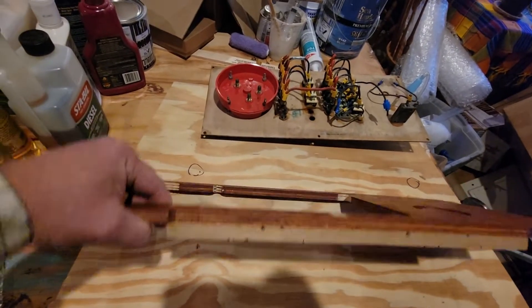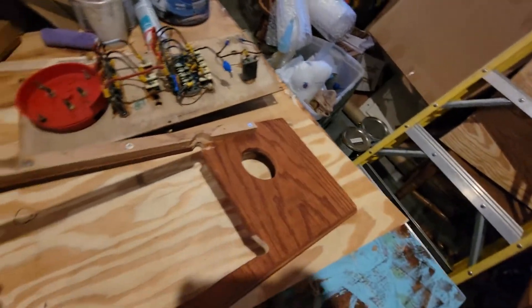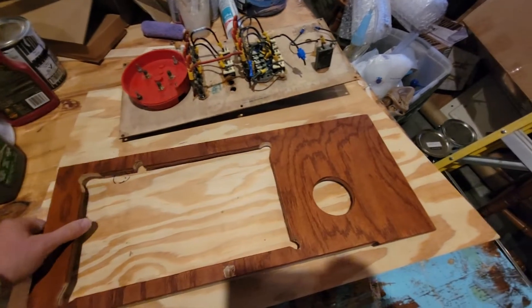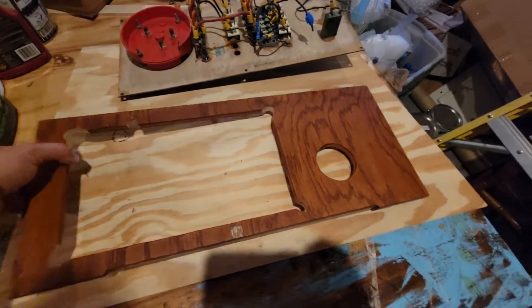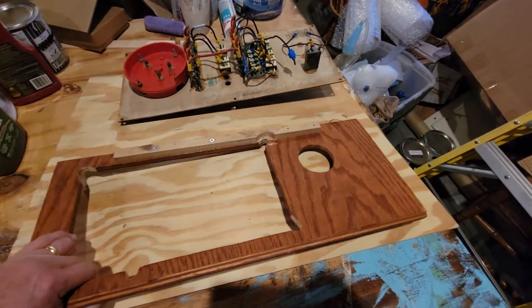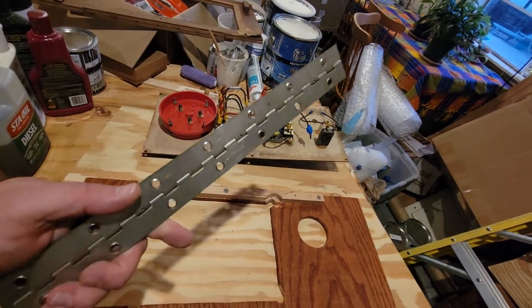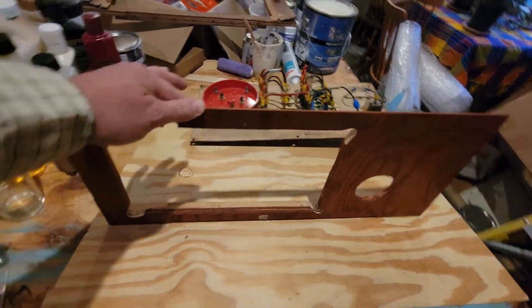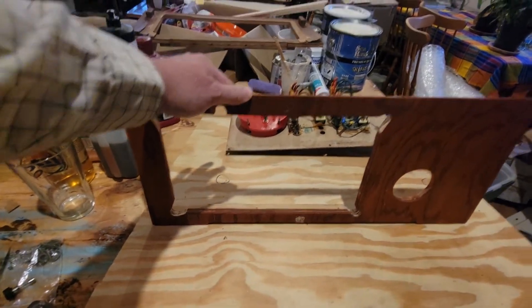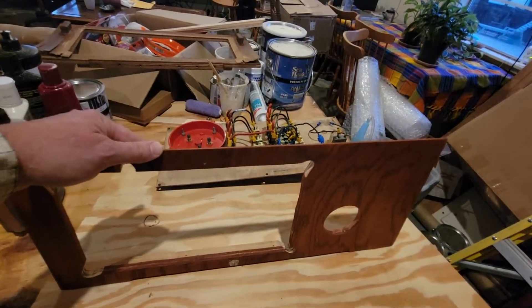So it's getting replaced with oak veneer — that's all I had locally. I'm not in a marine area; I'm in the north part of Mississippi. I got half-inch oak veneer plywood, veneered on each side. It's probably the most expensive piece of plywood you'll ever see time-wise. The second one would take me an hour to do; this one took a while to design. The big part was getting the piano hinge mounted in the boat exactly where it needed to be so this closes perfectly. It's a little harder than it looks — like mounting a door with the door shut, not being able to go into the room you're mounting it in.